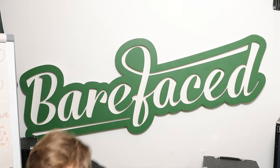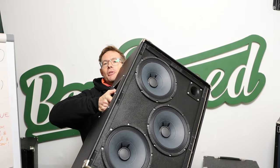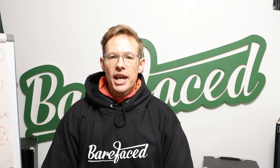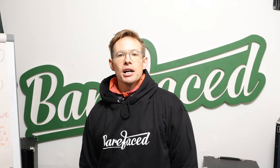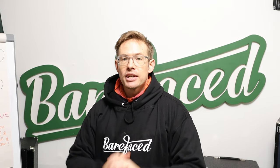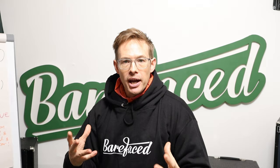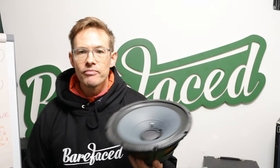Hello, I'm Alex from Barefaced Audio and this is our new 310, which comes with a grill if you buy one, but we've left it off so you can see what's going on. It's three of our epic 10CR drivers. We've had them manufactured in an alternate impedance to solve the impedance puzzle, because otherwise the impedance would be annoyingly low if all parallel, or annoyingly high if all series. That isn't always possible but took some work and juggling, and yes we have an alternate impedance 10CR250 which maintains the exact same tone and sonic performance — efficiency, power handling, ability to move air, which is X-max times SD volume displacement.